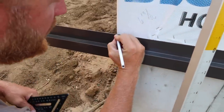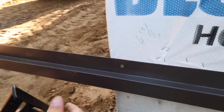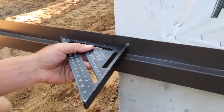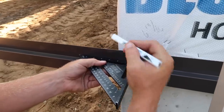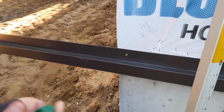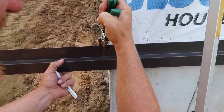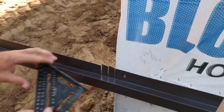I've shown this before but we're going to do it again. I'm going to square up a line right on the edge. We're always going to take this dimension times 2 - this is usually 7/8ths, always double-check it though. Just barely over 7/8ths times 2. The reason I do 2 cuts instead of 1 is it's just nicer and easier to make this cut and bend with a smaller piece of steel. So once I've got them marked, I'm using my greens. This is the cut that sometimes people don't think you have to make, but I like to make it - square this down.